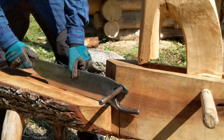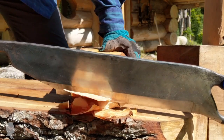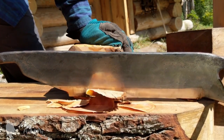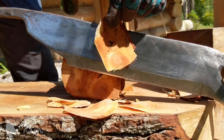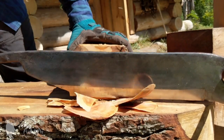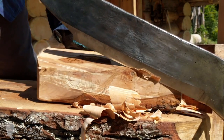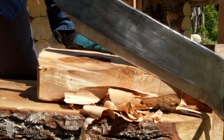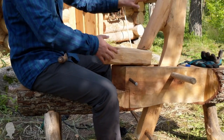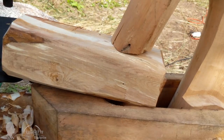Usually, a clogger's knife is attached to a base through its upper reach extension that is shaped as a hook. The clogger's knife topic is pretty broad and interesting — if there is enough interest from my viewers, I will make a separate video about it. Note that the knife's pin attachment will not interfere if the shaving horse is used as a vise. I used the draw knife to shape my mallet's head just to prove that point.